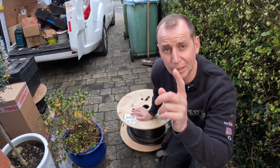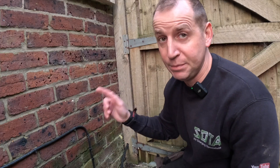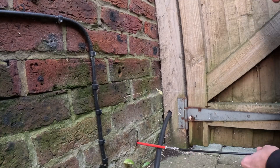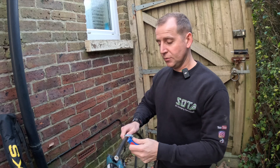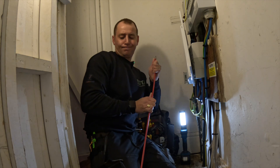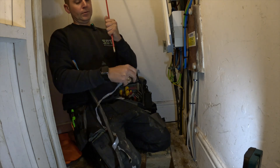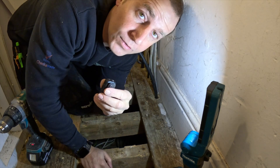I don't know if I've got enough cable on this, it's going to be touch and go. In my Monday morning keenness I've pulled the rods through too much and it's gone, but I can feel the end of it. I might be able to thread another rod on it and pull it back. I'm not going to get this through with the rod the way it is, so I'm just going to strip a bit back so I can tape it onto the rod. And that'll do me - let's see what's left on the drum. Absolutely bang on.